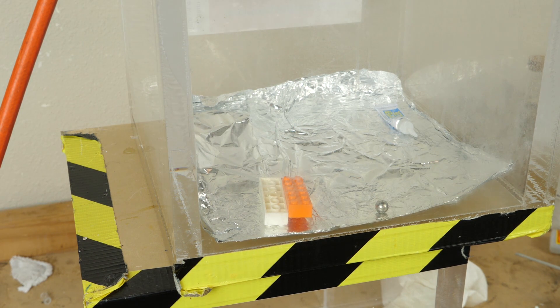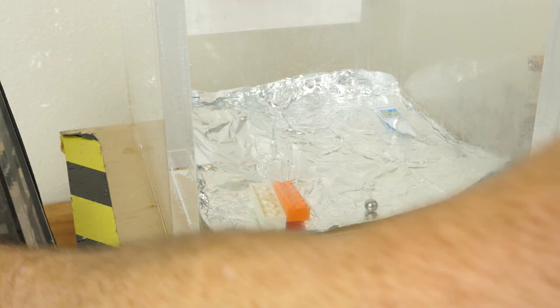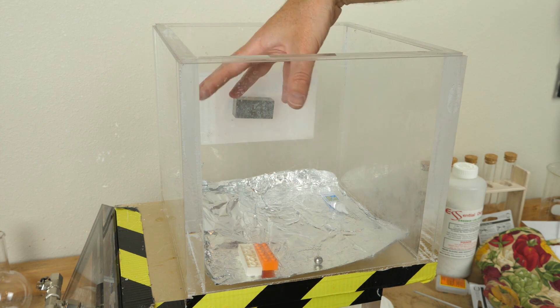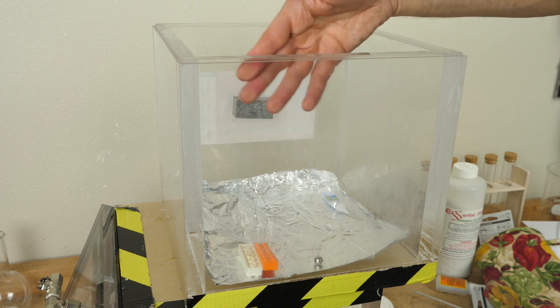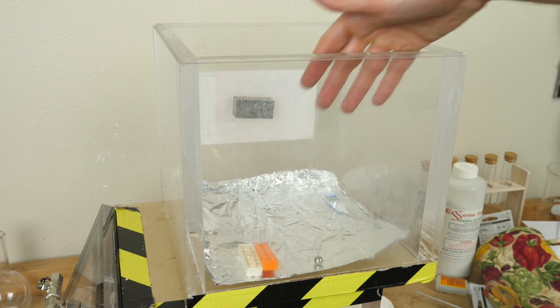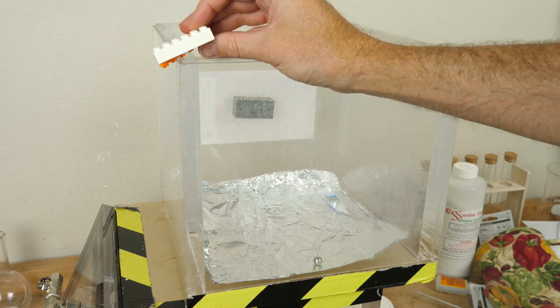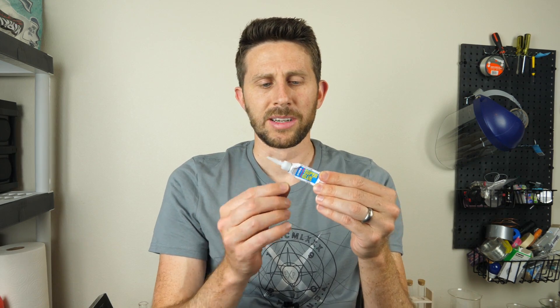Let's let the air back in and see how well they're bonded. Those are some really strong fumes when I let the air back in. It's because all of the super glue had evaporated into the air, and when I let it back in, it immediately started reacting with the moisture in the air on the sides of the vacuum chamber — you can see the vacuum chamber is now just cloudy. These are completely bonded together. I was actually kind of surprised by this — I didn't think the super glue would be able to bond in the vacuum chamber, but it looks like because you only need one molecule of the hydroxide ion to start the chain reaction, even with a very good vacuum you're still going to have at least one molecule in there that can start the polymerization.